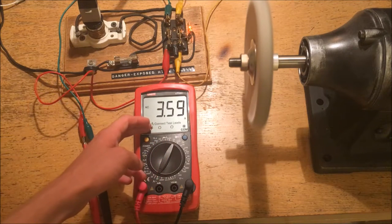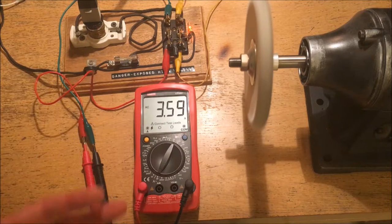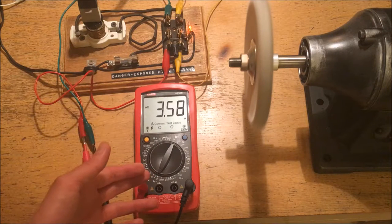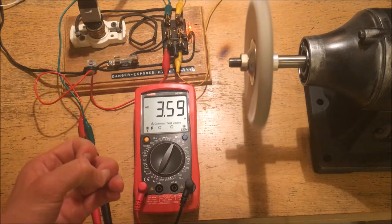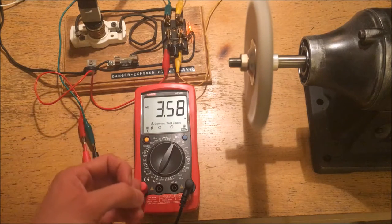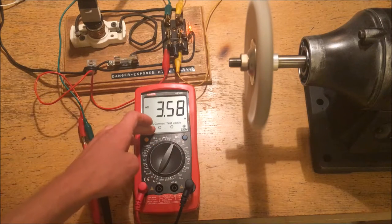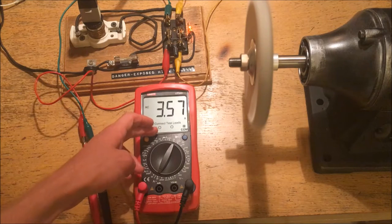So is it really dumping out 400 watts into the ambient area just by vibration and friction with the air? Well, not really. What it's doing is it's producing a lagging phase — the current is effectively lagging behind the voltage applied to it — and because of that current lag, it's resulting in a greatly increased current demand above what you would expect for this power load.